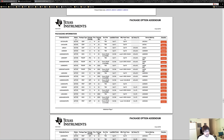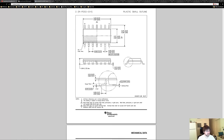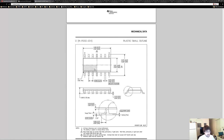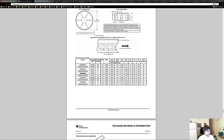The package drawing, denoted in this column — PW for TSSOP and D for SOIC — will be reflected at the bottom of the datasheet. Here's the D which is for the SOIC part, and it gives you the dimensions. Here's the PW for the TSSOP part. The TSSOP part is smaller and thinner than the SOIC part — it's for very thin designs. But we only need to care about the SOIC part. LM324MX is the SOIC part, so I'm just going to copy that and go to Mouser and search for the LM324MX.